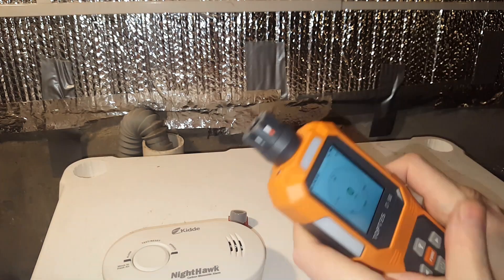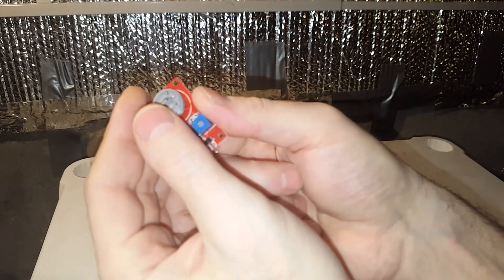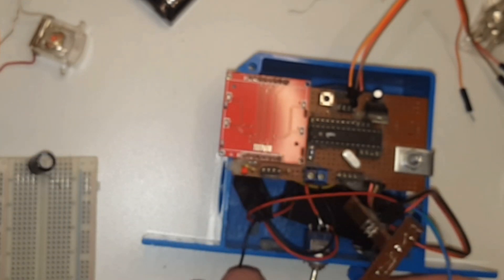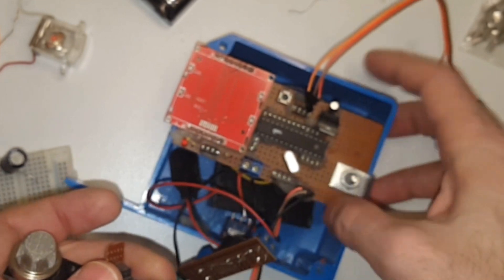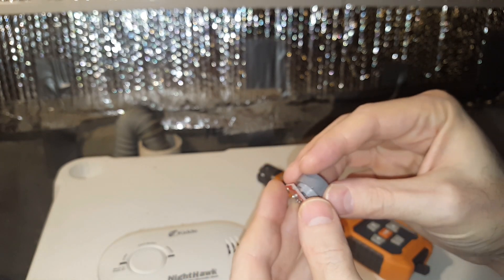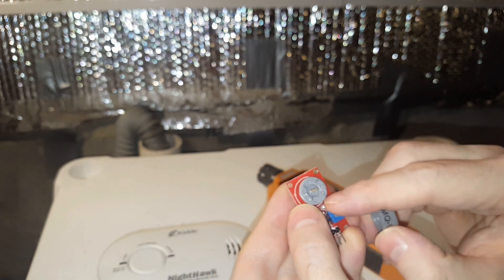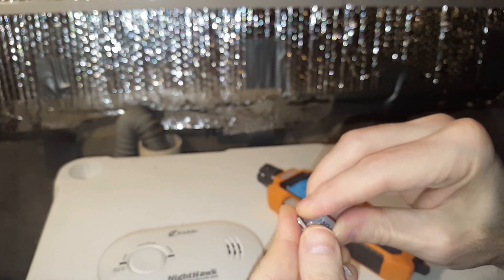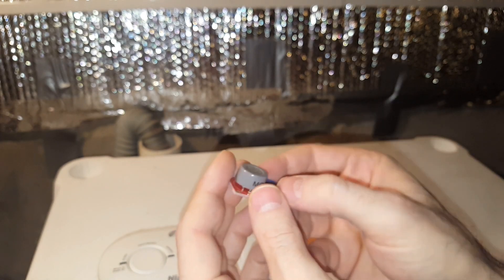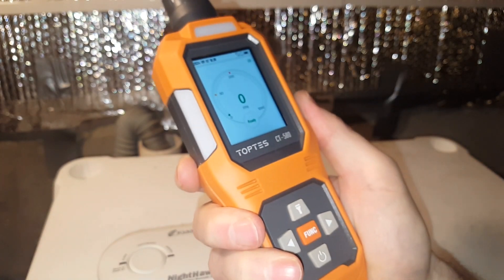What's inside there is an analog sensor with a lot of electronics — it's an MQ9 sensor. I'm showing you this because I had bought these to try to make something like this myself using a microcontroller like an Arduino. What it does is heat up that sensor. Some sensors test for changes in air moisture, but some are specific for different kinds of gas. This one has a carbon monoxide sensor specific for carbon monoxide, and I never really got the DIY version to work.